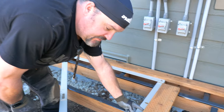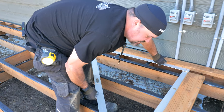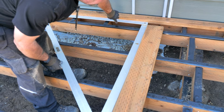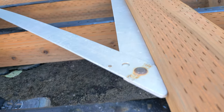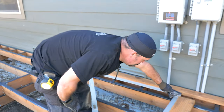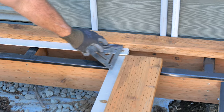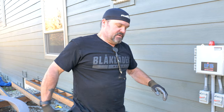I've got a gap here, I've got a gap here, and I'm tight over here — so that means I've got to move this board that way a little bit to try and average this out to square. I'm just going to take my square until I like the way this looks. Wow, that looks pretty good. Most guys use a speed square to do this. Yeah, we're square.